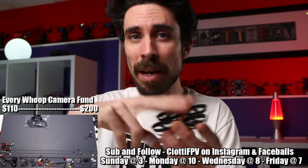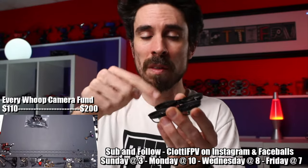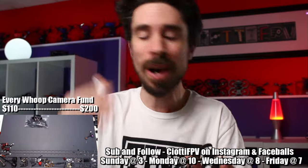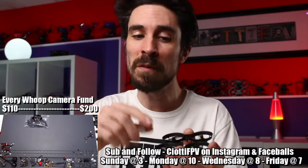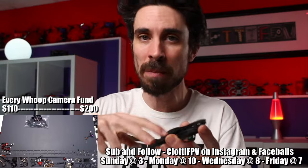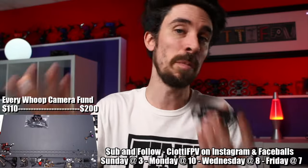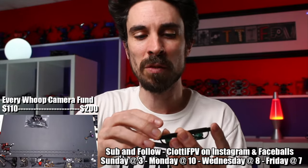You can leave the propellers on, and then if there's one of them that's vibrating harder than the others, first things first, change the propeller out, because that's probably where the problem is. If that doesn't fix it, or if you want to just check the motors, take the propellers off and do that same deal. With the propellers off, obviously you're only testing the motor with its vibration.